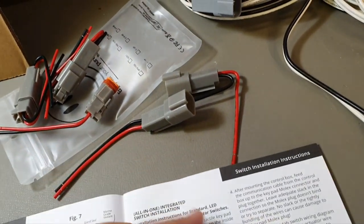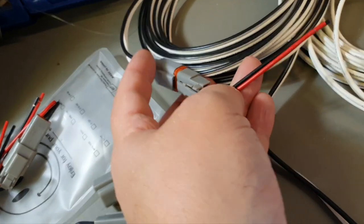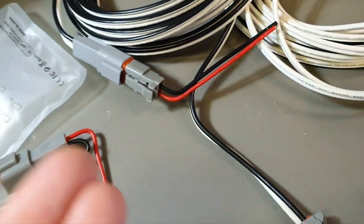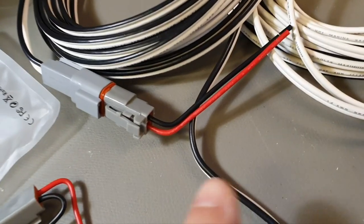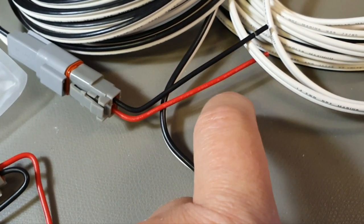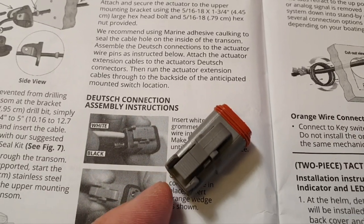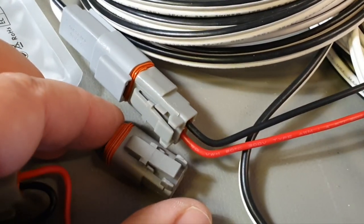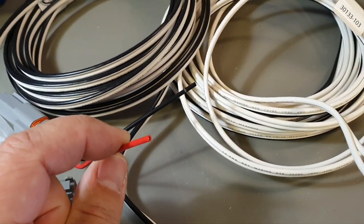So what am I going to do then? I take one of the pre-wired connectors that I bought on Amazon. I put it here, like I already did here. So we imitate this being on the wires of the actuator. I hope I explained it clearly. And now we just need to figure out where we connect red and black on the actuator. We just look at the structure and compare. So white is here. Well, in that case, it means on the position of the red cable. So we will need to connect red with the white of the actuator.